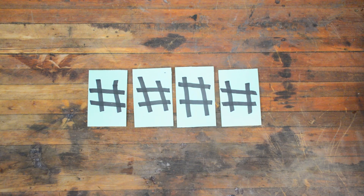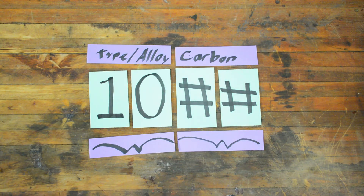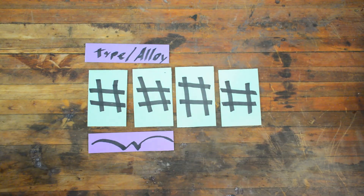Here in the US, we have two different grading systems we use to categorize steel: the SAE and the ASTM. In fact, this was the reason for most of my confusion when trying to figure out how steel grading worked. They both use a number code or a number-letter code in order to indicate the type of steel being used. Starting with the SAE — this uses a four-digit code to describe the makeup of the steel. The first two digits indicate the type and alloy of the steel.